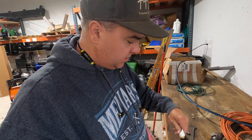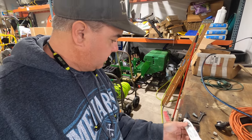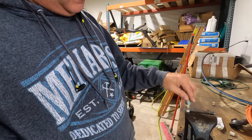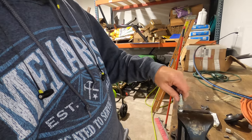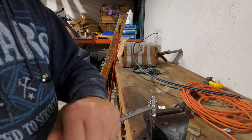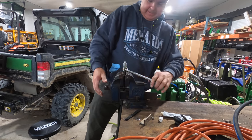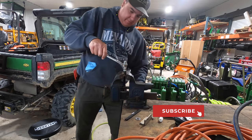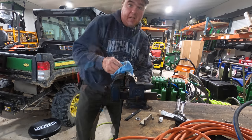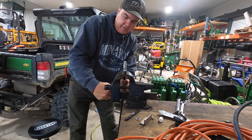When I get a hose like this, I request a swivel on one end and just a solid fixed connector on the other end. I'm going to put some pipe dope on here. If a little does a little good, a lot will do a lot of good. These are pipe threads on this particular connector. Anytime you're using NPT pipe threads for a connector, you have to tighten them well. I found that as I'm working with hydraulic stuff more and more, I just have to go through more shop towels. Hydraulics are a mess.